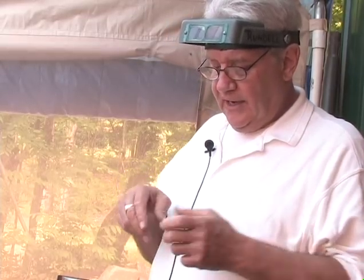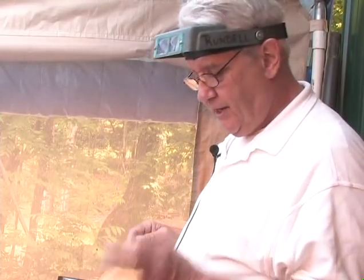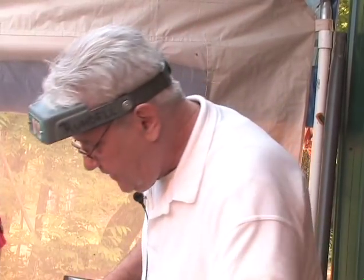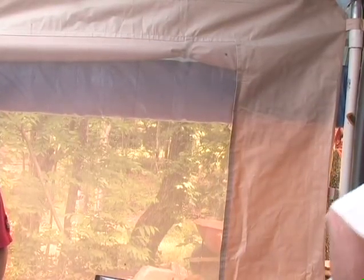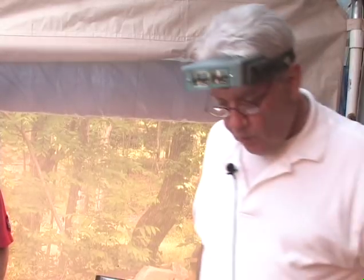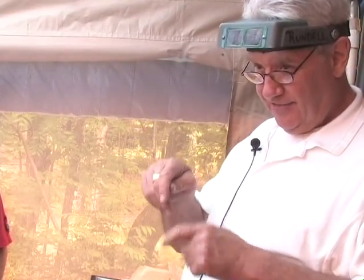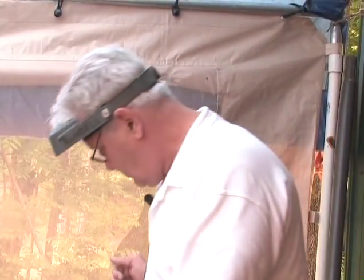Once you've taken your sheet gold and you take a piece that's just a little bigger than the cavity you want to put it in, and you put it in that area, I use a very special sophisticated punch that I can't find, but what it is, I take a chopstick and I cut it about this long, and I round it off, and I use the chopstick to set it. They're almost always bamboo. Japanese engravers use this method. I didn't know that.